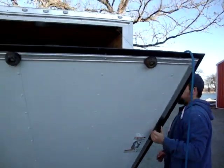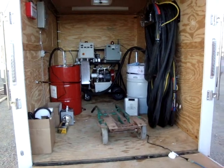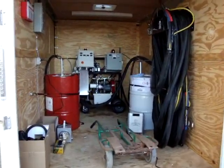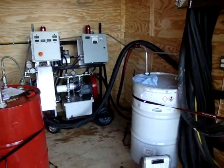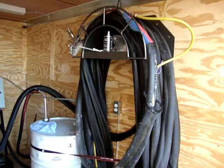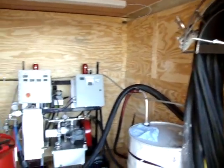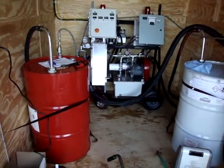We'll get an internal temperature of this trailer in just a few minutes. We've got the new CDS machine in here — 50 pounds a minute, over 3,000 PSI, two drums, 150 feet of hose, and a Graco Fusion gun. We're going to go through the entire startup on this thing this morning so you can see exactly how this machine runs.